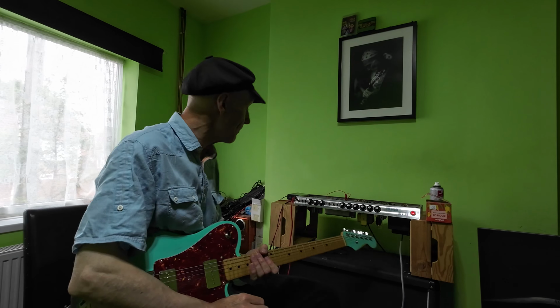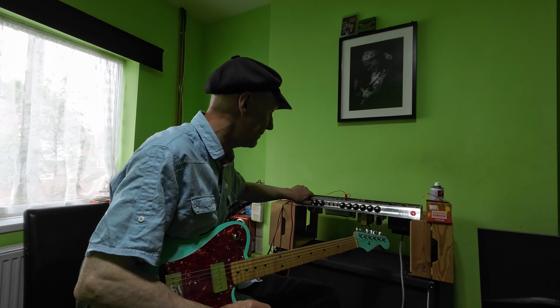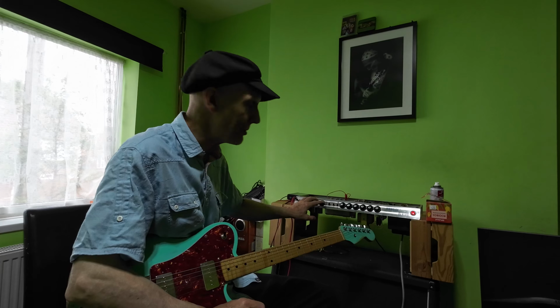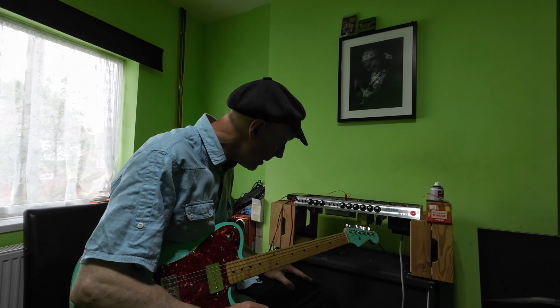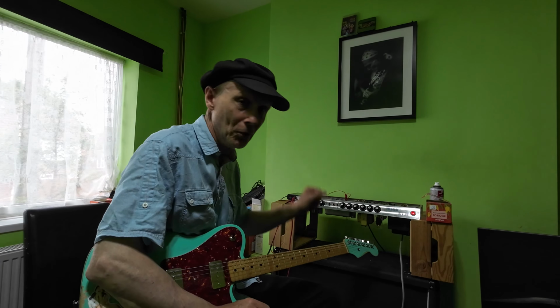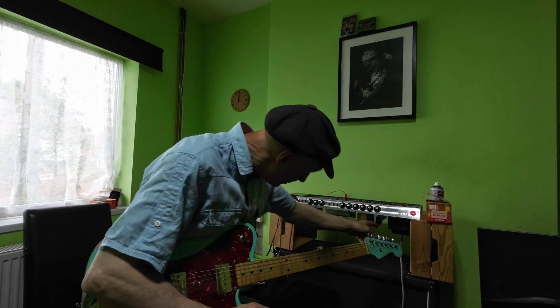Fender tone to it. Well, sounds okay. As I say, we've got a few issues. We've got a really conductive board, which is obviously leading to these scratchy parts. We've got mismatched tubes, but again, is part of that down to the board? Part of it will probably be just general wear and tear on these tubes.